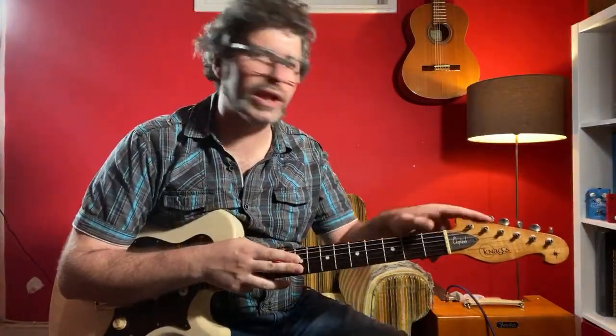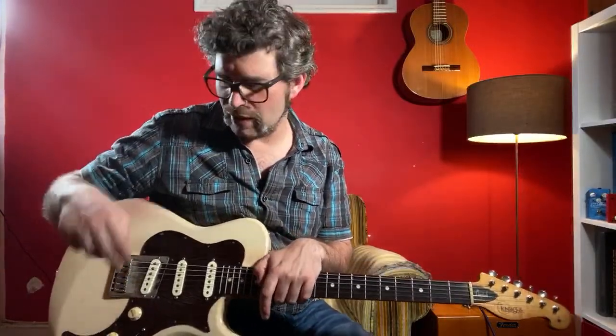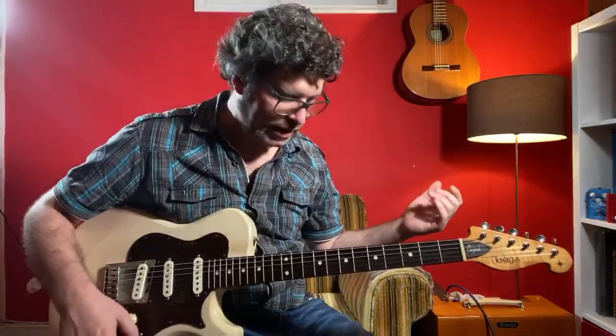I'm building a new guitar here in Portugal. Well, I'm not building, I ordered it from Few Tone Guitars. And we have installed in the volume pot two treble bleeds, because there are different values you can use, and one without treble bleed. So I have a three-way switch over here that I can choose if I want treble bleed A or treble bleed B or no treble bleed. Exactly because of that. But 99% of the time I want the treble bleed, because I want to have a clean tone and be able to make it quieter